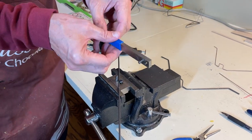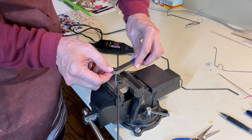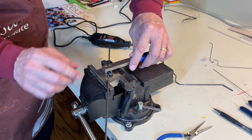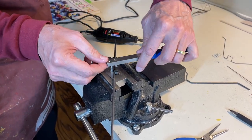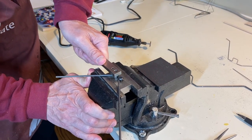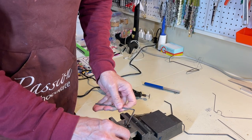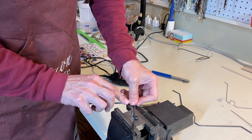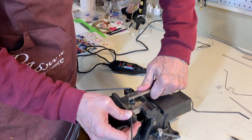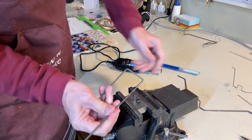We're going to take this handle — again, very strong metal — and put it here and use this to bend the music wire around. You can see I have the pin up against the music wire. It takes a little bit of effort, but we can bend it. And here is the music wire bend. We can follow up with additional bends — notice that I keep it very flat here for the 90-degree bend. We put this back in place and literally bend it around that post. And here we have a 90-degree bend.